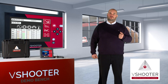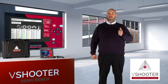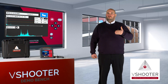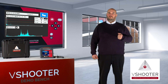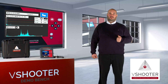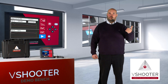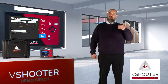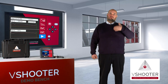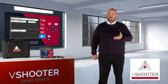In the V-Shooter, you can access all overall value data and all spectrum data. The V-Shooter is also dedicated to predictive maintenance, so it means you will be able to make trending. Trending means that you can make measurements every month, every two months, every three months on your machine. Just go to the memory, check back the machine, and make new measurements. Update your measurements, and then you will see your new condition today.